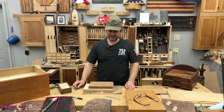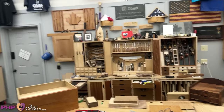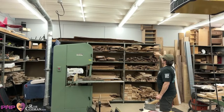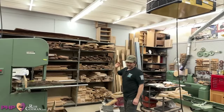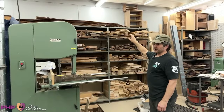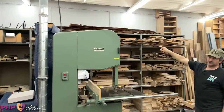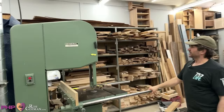If it dries out, it cracks. I've got two caches of veneer — one up here has all the long stuff: mahogany, walnut, cherry, ash, birch, sycamore. I just lay it flat, and why not keep it in the exact same environment that you're going to be working in? The problem is that when it's been moved multiple times and handled, you've got to be really careful — you go to pick this up and it splits. They'll tape the ends to keep them from splitting. There's a lot of waste in veneer; you usually end up having to cut around defects.